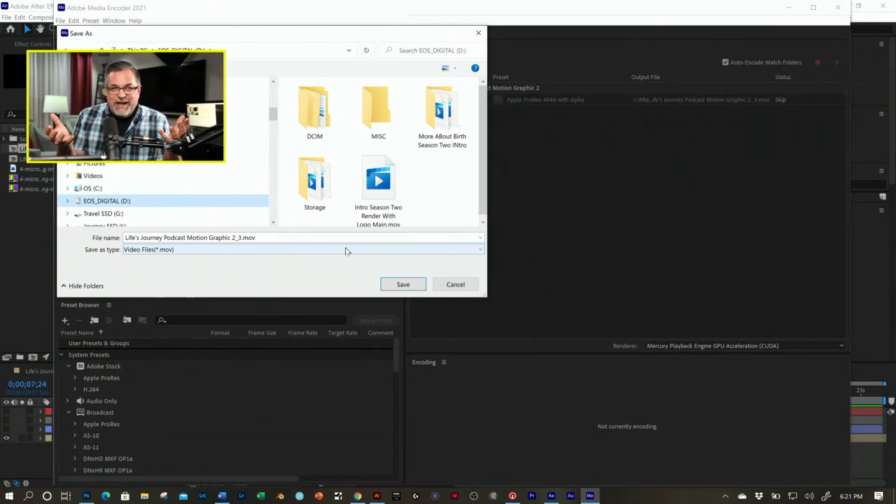I don't know if that'll ever change. I'm sure it was because the other switches needed specific abilities to have the same thing coming from the Hyperdeck, so there wasn't any problems with the live event, so it forces you to render it correctly or it won't read it at all. And now we have the ATEM minis, and they're able to adjust everything coming in the inputs, which is great. So you could plug a phone into an HDMI input, you could plug a camera at a different frame rate, and it's going to bring everything down to the frame rate that your program out is set in your control software.